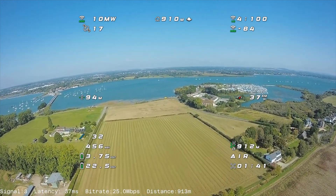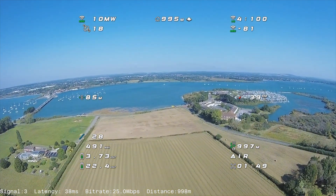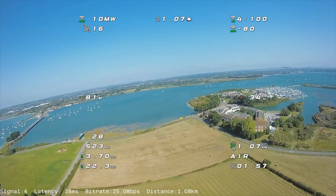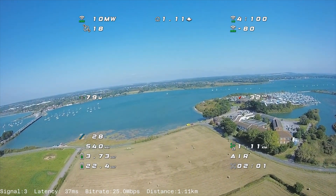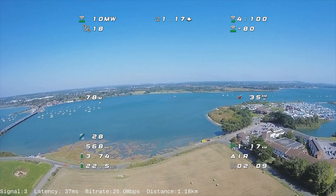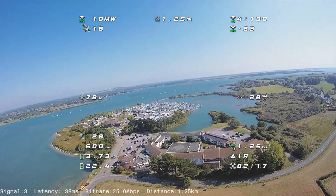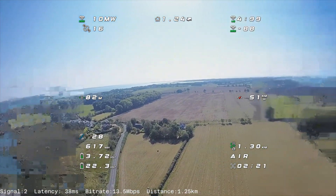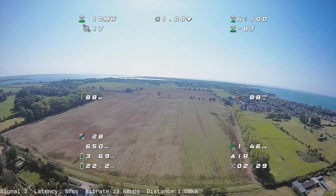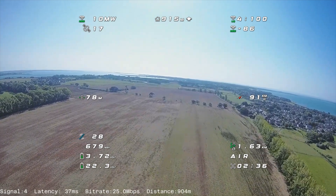One of the issues with using the pigtail is: are you introducing more loss by having this pigtail, even though you get a bigger antenna, as opposed to having a direct connection UFL with a shorter antenna? I'll compare that when I look at them side by side. But if you look very carefully, you will see a little flicker of focus mode coming on — this is when the signal drops to two. It's not on for long and then it seems to recover, but it is definitely there. People have asked me why I'm using focus mode — aside from the fact it warns me that the signal is getting lower, it's also a good way of keeping the latency very consistent, so that the latency doesn't spike. I prefer blocks at the sides rather than latency spiking.